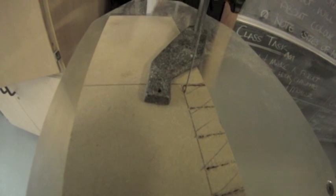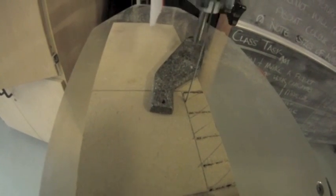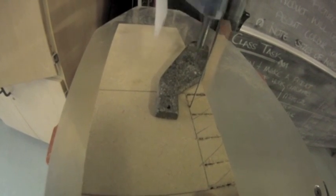So the second method would be using a jigsaw. You can see the original 5 cuts. It's carefully turned on spot. Note that the jigsaw has the foot resting on top of the material. I think we can see fairly clearly, cutting just on the waste side of the material as it goes across, those extra cuts allowing the waste material to fall free.